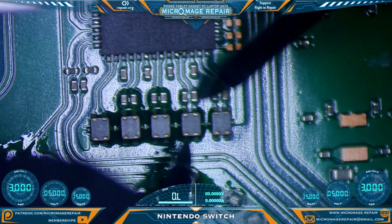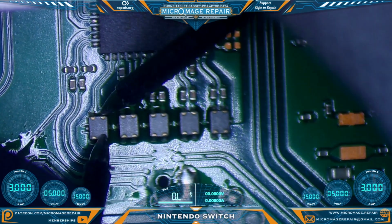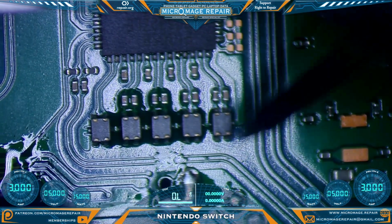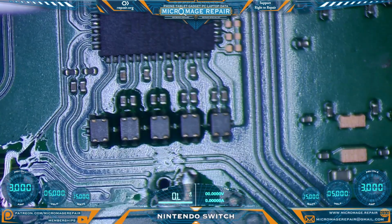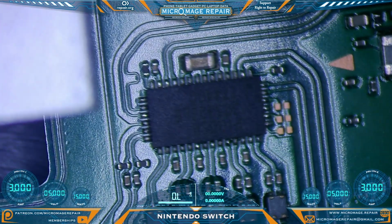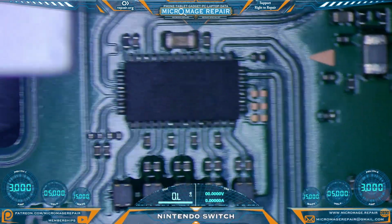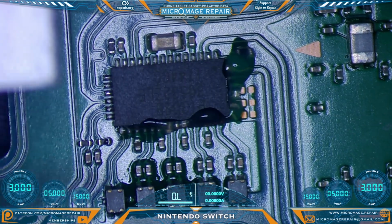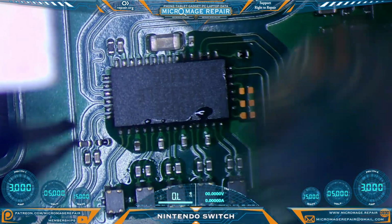These filters should have continuity going straight through, but not side to side. Alright, they do not, and none of them should be shorted to ground. Very good. So, we have a host of problems. Not only did we have a port issue, we have a Pi 3 USB issue and an M92T36 issue. I think our process here will be to pull and test, just to be sure.